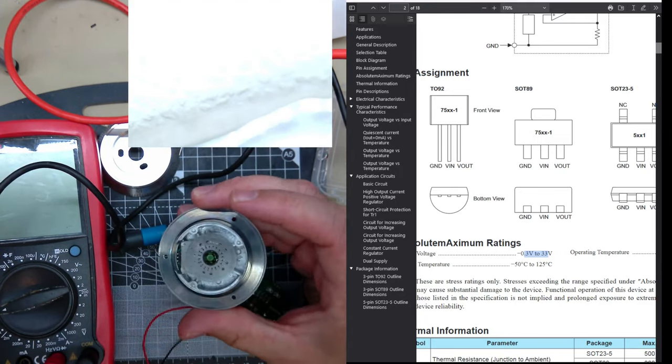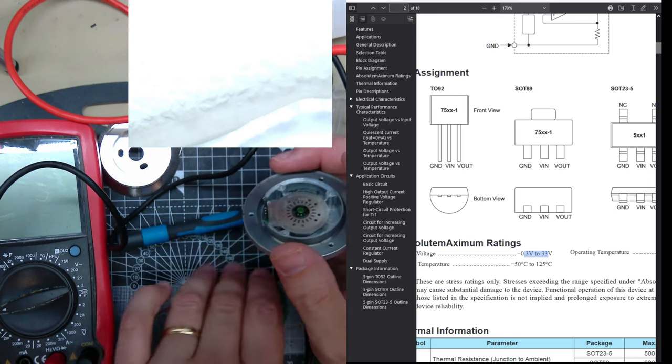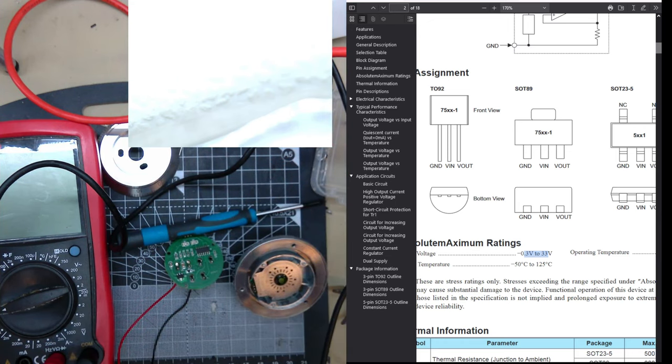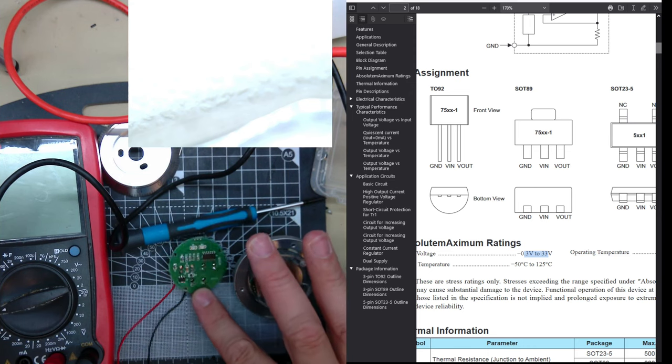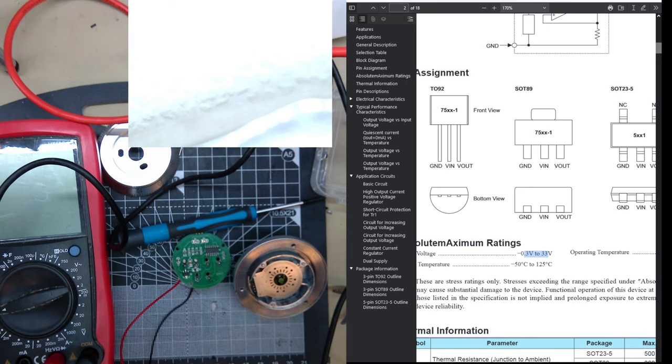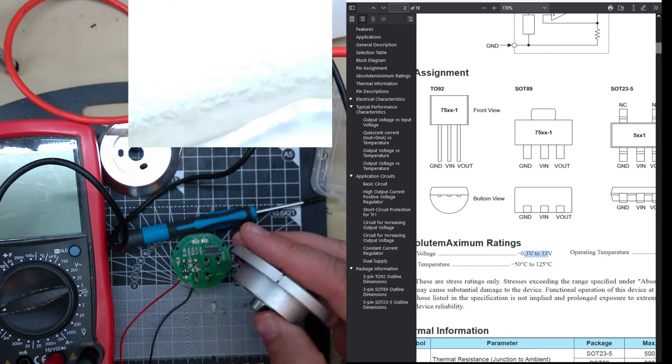Anyway, I've trashed this. I might see if I can replace this chip. I don't think I have that in stock. It's probably C14. No, I don't think I have it in stock. So I will stop this here and tell you be careful with these encoders and don't put 12 volts into them. This might be repairable. Anyway, on my next video I'll be maybe using a different encoder whilst the other one comes. It takes about a week to come in the post.